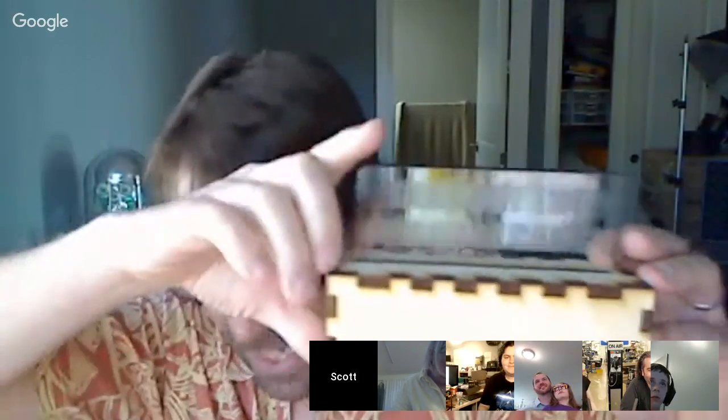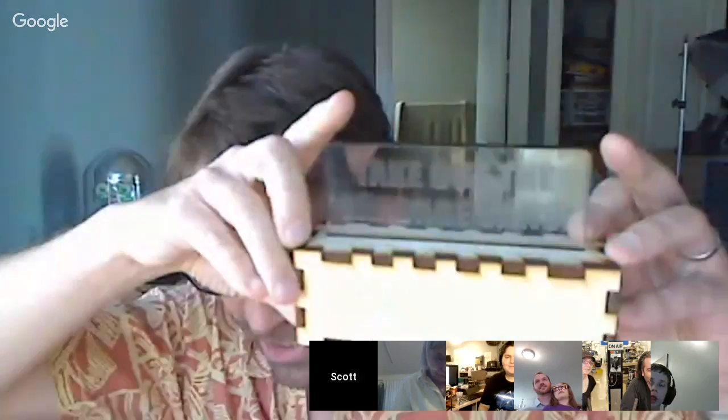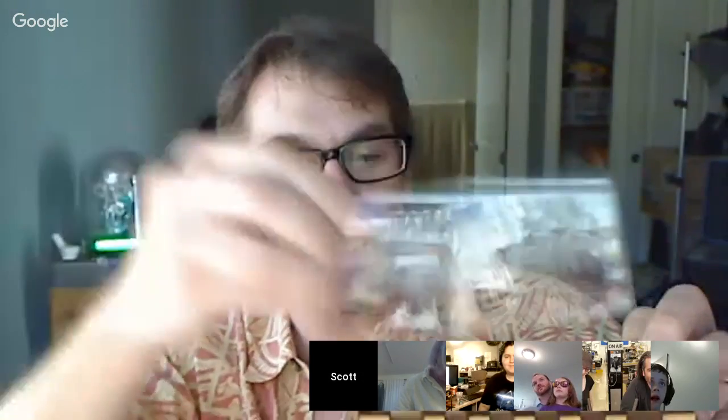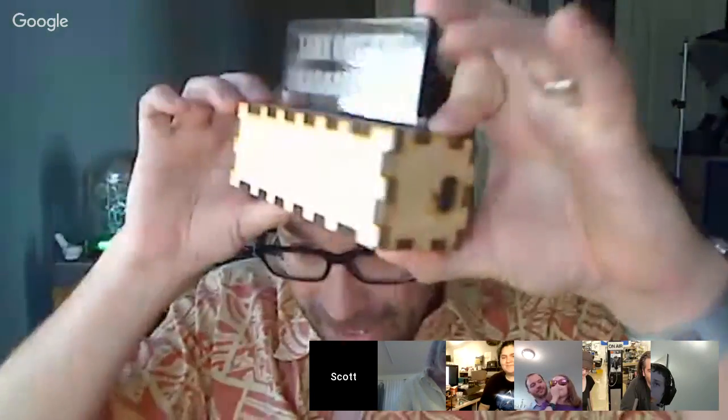And then I have an ESP8266 Feather inside that has a clock, and it says, on Thursday night, it turns red at 8 o'clock, so I know to take out the garbage. And then when I take it out, I can push the top, and it turns green to know that I've actually done it. So the bottom of this is basically sitting on a couple of switches that have NeoPixels underneath that turn color. And it's battery operated, so if the power goes out, I still remember to take out the garbage. So yeah, I have a million little things to keep life going.